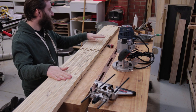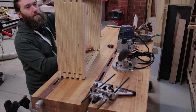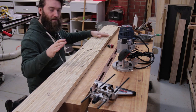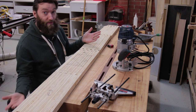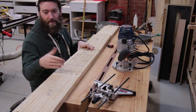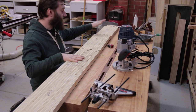I've laid them out edge to edge — this is how I'd fold it up, so when it's actually glued up into a case it'll come out round like so. It's important to lay this out now so all the opposing parts are in the right spot. I've clearly labelled the inside with a sharpie: front piece, base piece, back, and top. I'm going to focus on the base and the top for now — they're both going to receive a large mortise for case fans.